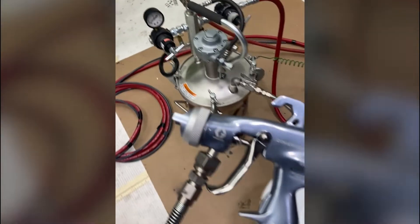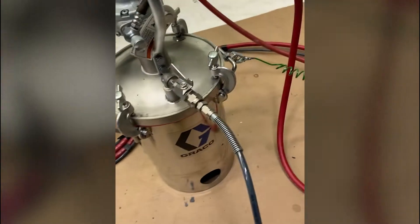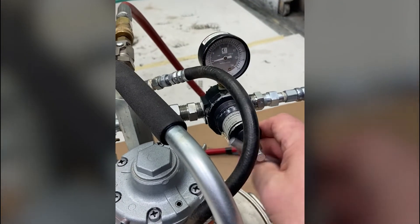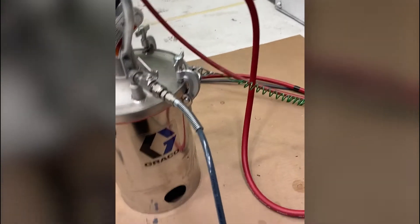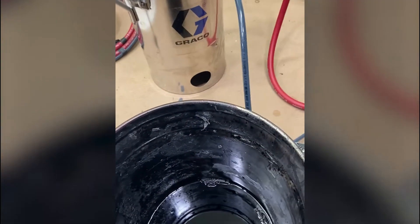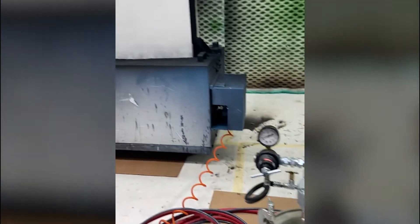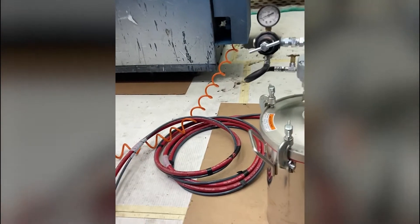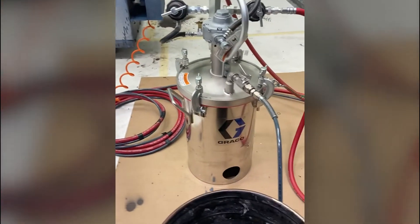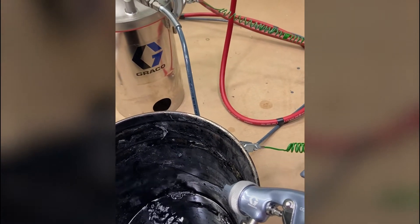Here's my gun — this is the Air Pro conventional air spray gun. I'm going to turn off the atomizing air all the way down to zero. I have a waste bucket connected to ground, the supply tank connected to ground, and my target connected to ground as well. We're not using electrostatics here, but we are using flammable paints, so safety first.